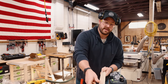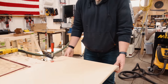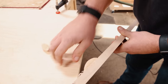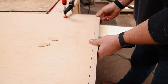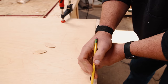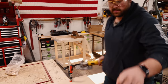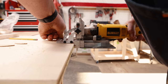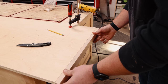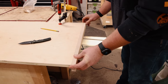Here we're going to use it to cut some slots — it doesn't actually matter because all it is is a point of reference to keep our edge banding nice and flat. So you see we've got biscuits in the edge banding. Typically the traditional way would be to take the center of your biscuit, line it up with your piece, take a mark, and transfer that mark. You don't have to do any of that here — just run a slot. Now it doesn't matter where the biscuits are because they align perfectly to the top, and you can shimmy them left to right to give yourself perfect alignment.